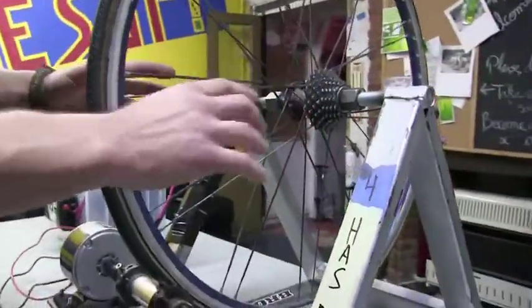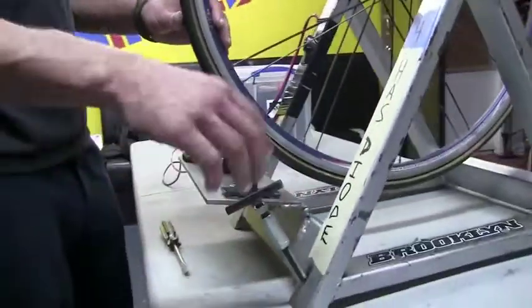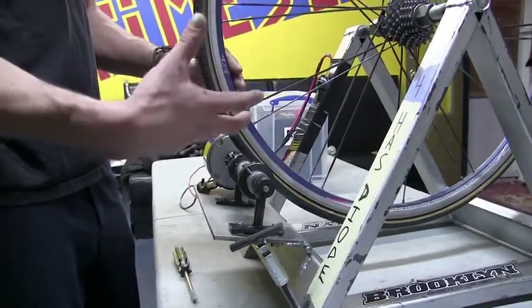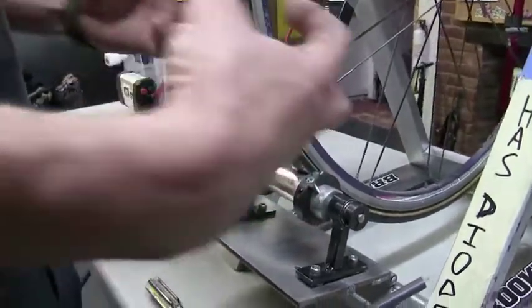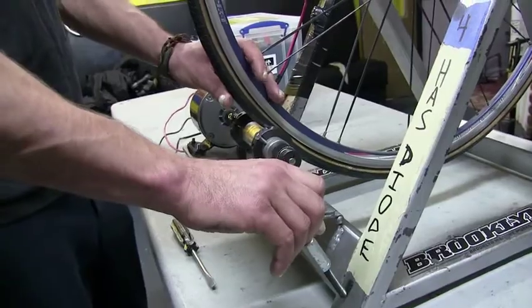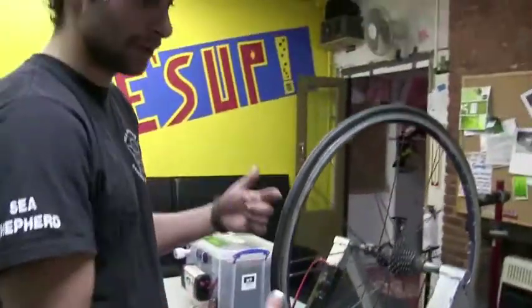You want to have as much pressure as possible while still spinning smoothly. So when you set up your bikes, you want to be using the spinniest gears possible. You don't want any resistance. Even though you think that might give you more spin, you want all the resistance to be coming from the tension of the roller against the tire. This creates more energy because the motor actually senses the inertia that you're putting into it. It's not only the rotations that matter, but also the force being driven. So you get it in a very spinny gear and you tighten it down slowly until you've reached the max tension that you can have and still spin smoothly without ever surging.